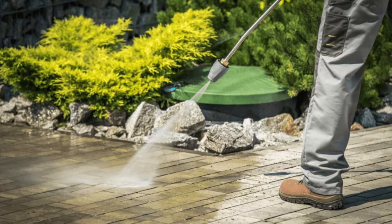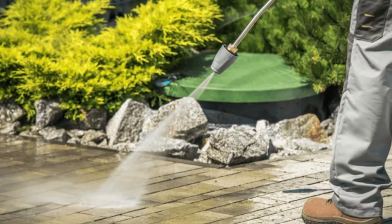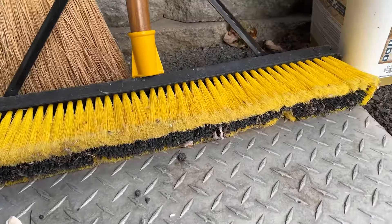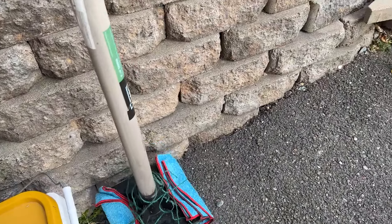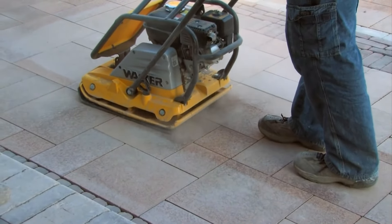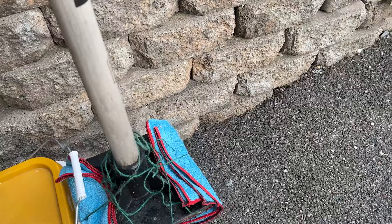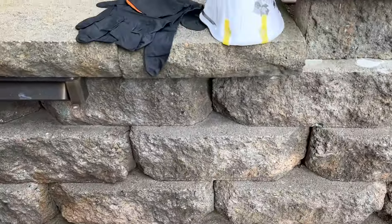For supplies, you'll need a pressure washer to clean out the gaps between the pavers, a large sweeper broom and possibly a smaller broom for tighter areas, the polymeric sand itself, and a tamper. In my case I'm using a hand tamper with shop towels wrapped around the base so it doesn't damage the stones — ideally you'd rent a tamper machine, but that wouldn't work on a walkway with steps. You'll also need gloves and a face mask, ideally an N95.